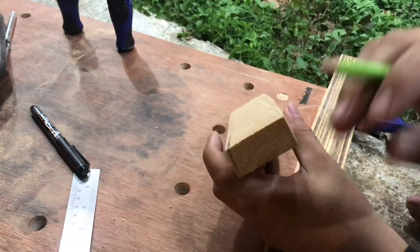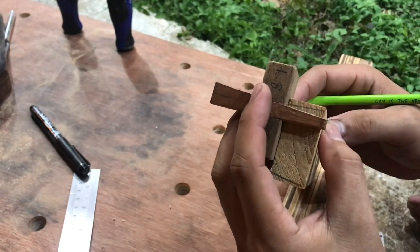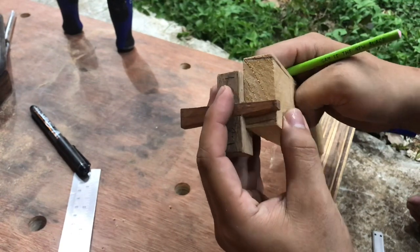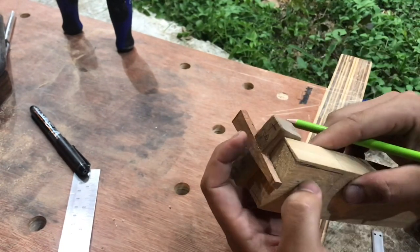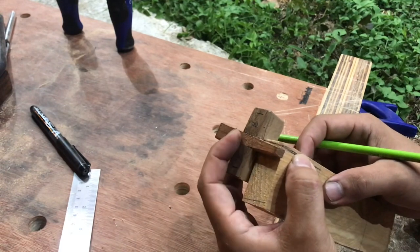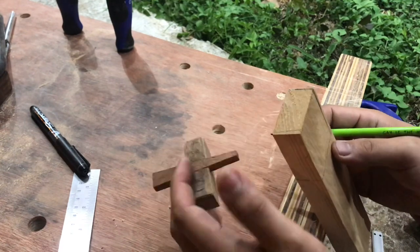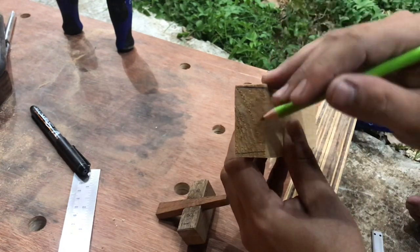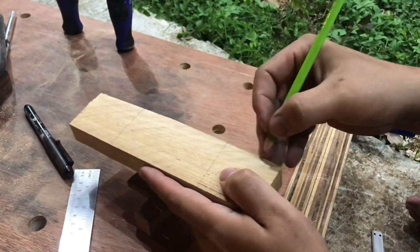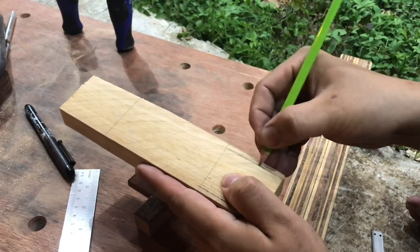Okay, so using your dovetail jig, this is also something that I covered in another class, which is how to make this. So you can go to the video, which I will also put in the description. You could quite easily make one of these and use it for marking out dovetails. In this case, you're gonna use it for marking out the sliding dovetail. So put down the two slanted lines and use your finger to trace out the last bit of the line.